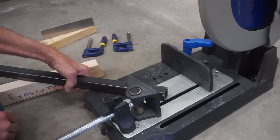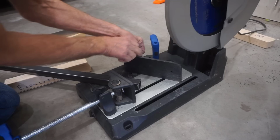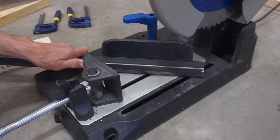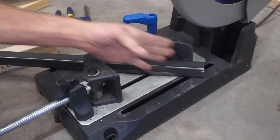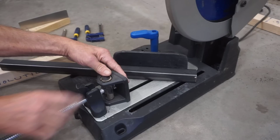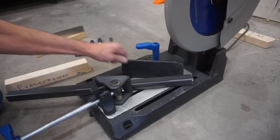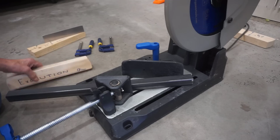And you can see when I rotate the fence on the saw to its maximum 45 degree capacity, that the angle of the cut needed and the angle of the cut the saw can make is off by 15 degrees. So I need to swing this piece around like this so that the blade and the cut line up. And here's that 15 degree space in between the fence at the maximum setting and the workpiece positioned where it needs to be for this cut.